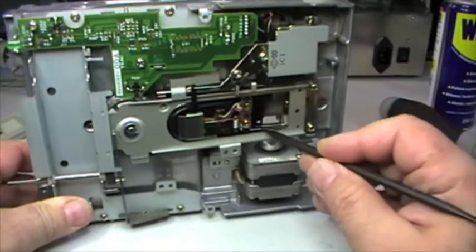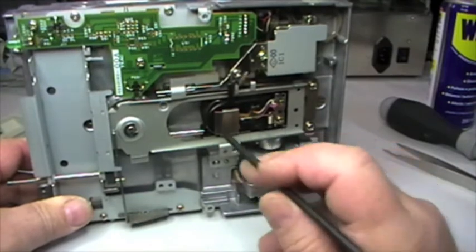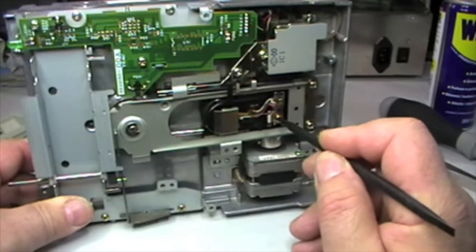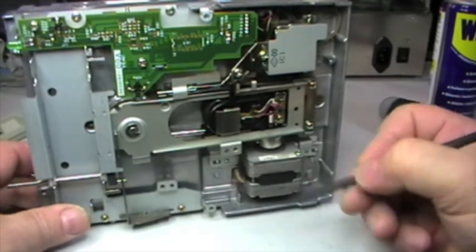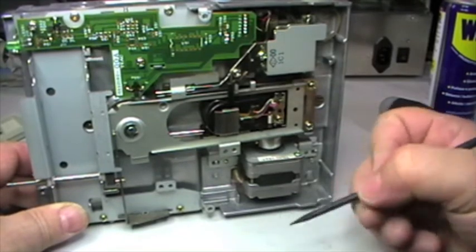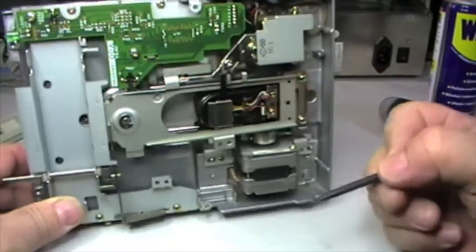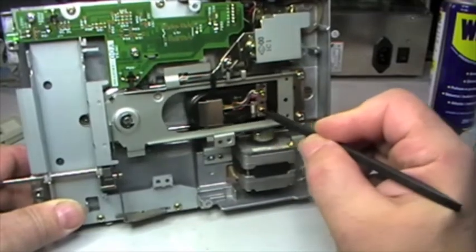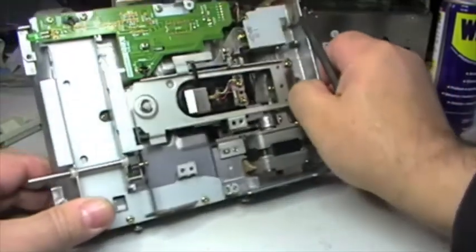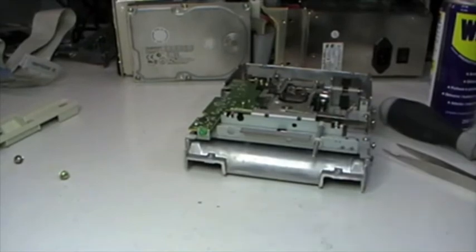I also have applied a slight lubrication on the sliding rods. I have used a special grease. It's a grease designed to lubricate high-speed spindles for grinder machines, which has the capability to remain with the same characteristics for years and years, so it should be good enough. So it's good enough for me, everything. Time to reassemble the front bezel, but before I do that I want to show something more.